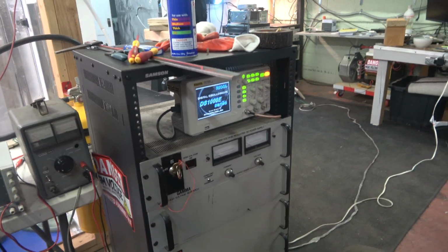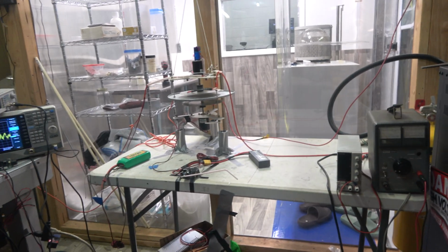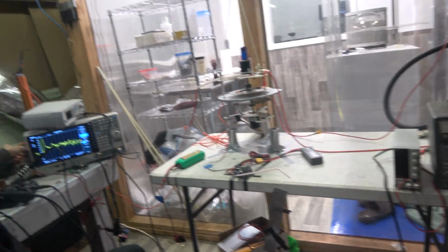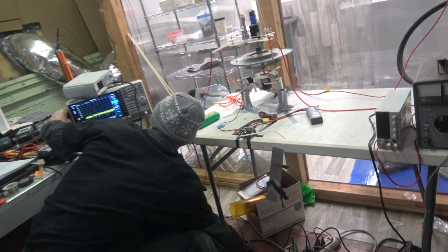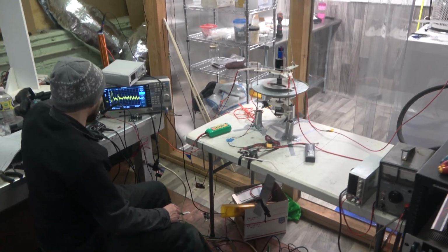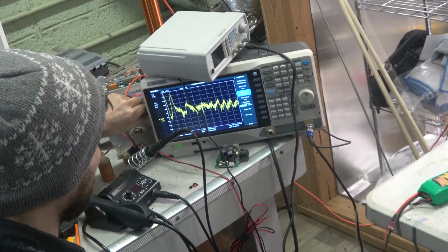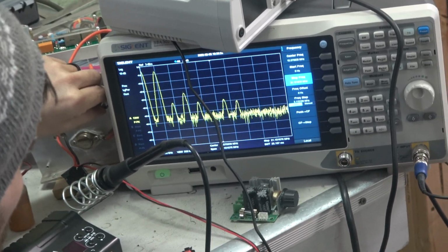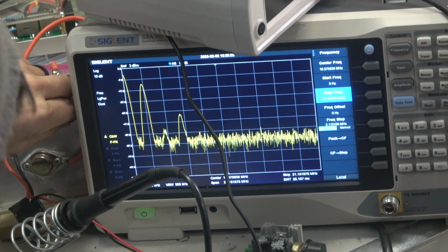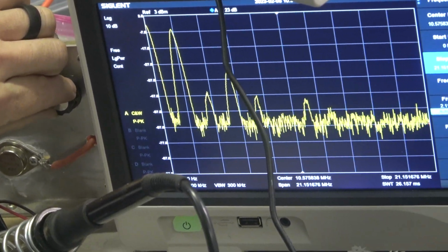Okay, so channel 1 on that scope is giving us the high voltage through the voltage divider. Voltage divider's fan is on. So now I need to get the Tesla coil roughly tuned. Don't turn it on yet. He's doing the Tesla coil now. Okay. Tuning the Tesla coil. So we got Tesla coil voltage. The piezo making any sound? The piezo's going to make a sound once we get the high voltage kind of roughed in. So you can see that he's got a lot of harmonic peaks here, but his tuner, there we go. Now it's in resonance, but his tuner has this interesting spot where you can get it right on the edge. And I've noticed that when I do that, I tend to burn out my can, but I do end up getting the best results because you're putting so much energy in so fast.